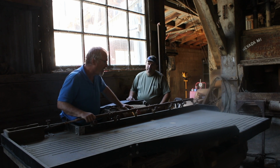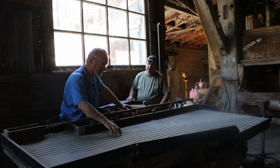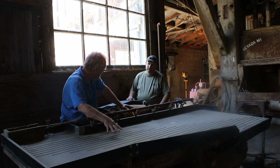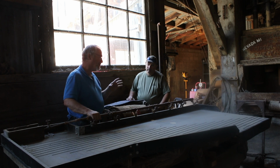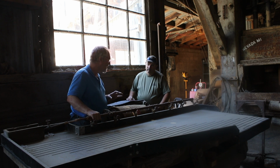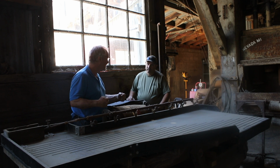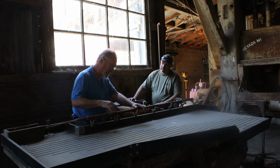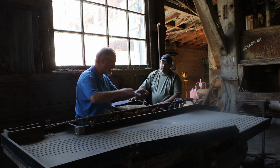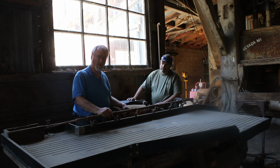They are a little tricky to set up. Part of the difficulty is getting them to the right angle. I've seen people try to just set them on a floor. The problem is they shake, and if they're not bolted into a concrete floor, then the whole unit shakes instead of the table. You need to confine the shaking to the table where you're processing the ore. So they have to be bolted to a hard floor in order to work right.